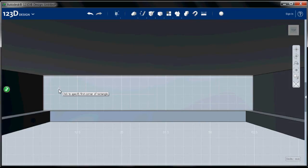And I mean pencil and paper sketch beforehand. It's always a good idea to start with a pencil and paper sketch before you start constructing things, at least until you get really good with the software. So this is a 27.5 millimeter wide hole that's 8 millimeters tall. That means that the first corner of it is going to be 15.75 millimeters in and 1 millimeter up.